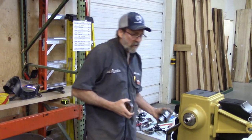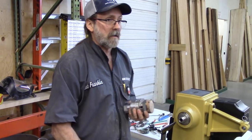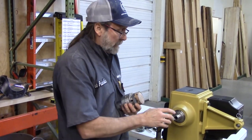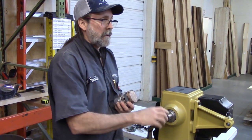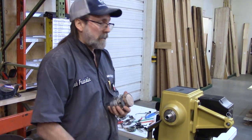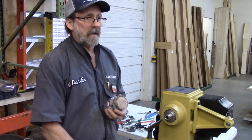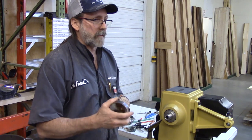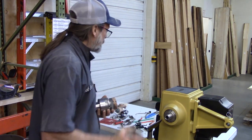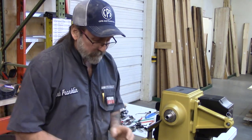When I first started turning, I didn't have a chuck, and I didn't have the money. I managed to get a tap that fit my lathe, and I tapped waste blocks, and I used glue blocks. Everything was glue. I did lidded boxes for 2 years probably, just with the holding power of glue blocks. So they're pretty amazing, the holding strength anyhow.